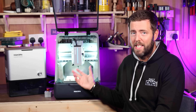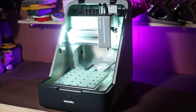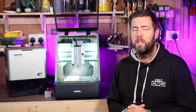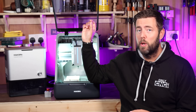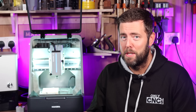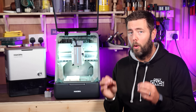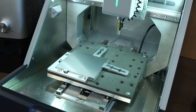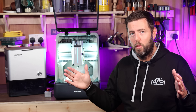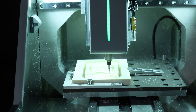The entire enclosure is built extremely well. The walls are actually double-lined — metal on the inside and plastic on the outside — which helps to insulate the machine and minimise noise. The lid is quite thick, but the hinges hold it up extremely well. The enclosure is also extremely well lit, and more importantly, lit from the sides. A lot of enclosures are lit from the top, which casts a shadow over where you are machining. Lighting from the side means your workpiece is lit up extremely well whilst it is machining.